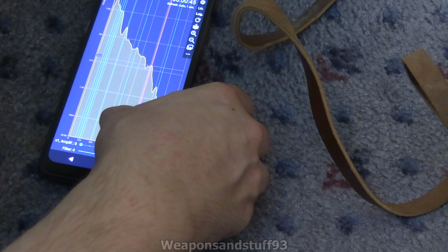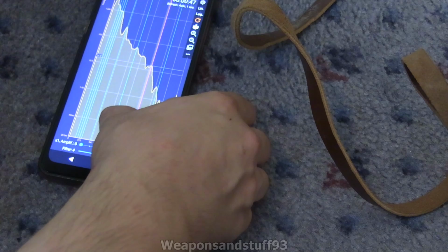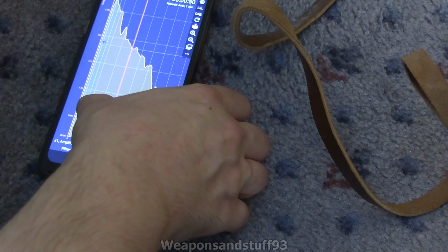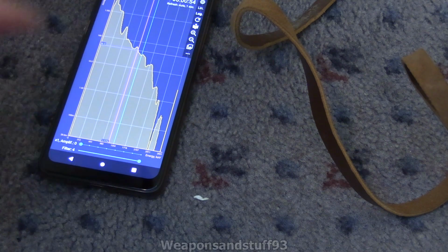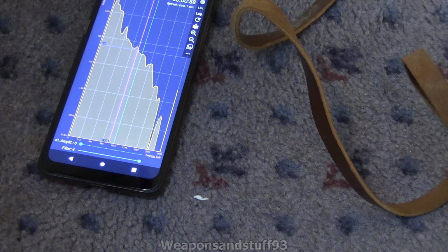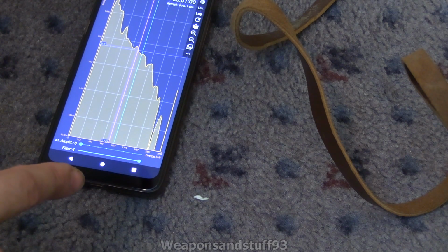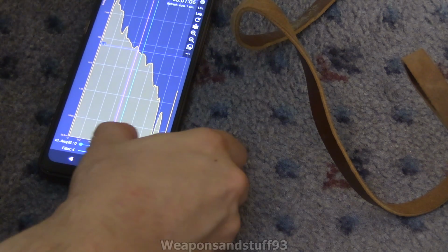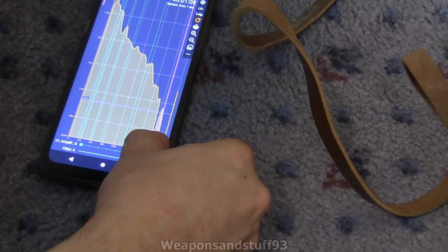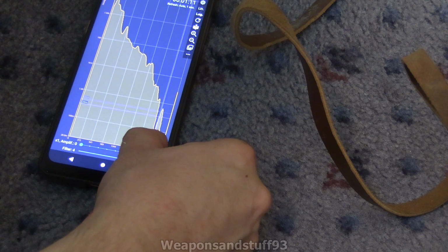Yeah, it seems to know there's at least some radium here, because it's getting a couple of the radium bits on it. But as I said, I think you're getting both breaking radiation from the strontium-90 inside hitting the bits of the Geiger counter, plus whatever you'd get in radium paint, so probably a bit of uranium and thorium as well. But we've got another big spike developing there. What's that one? A thorium spike again, interesting.